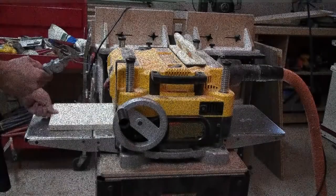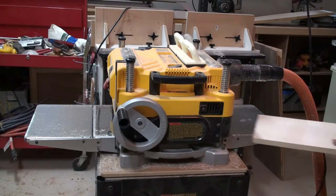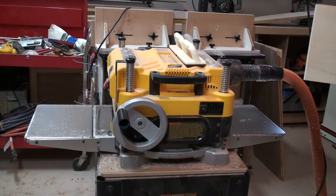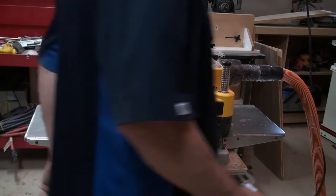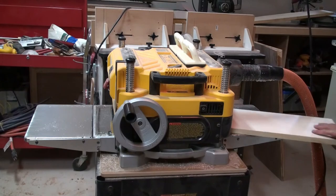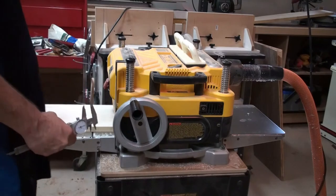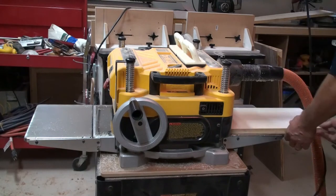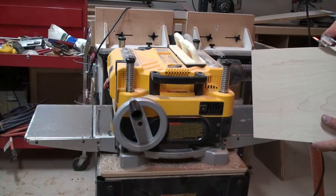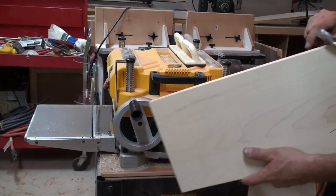You see the calipers there that we're going to use to verify that in fact we do have it to 3/4. And the 3/4 of an inch is not critical here, as you'll see when we begin to machine this part for the Rose Vase. It's not absolutely critical. As you'll see here, I got well within a 32nd of an inch of that 3/4, and it's going to take one last finishing pass here. Verify that I've got my 3/4 of an inch for the inside and outside of the vase, and I do, and so we'll move on to the next step.